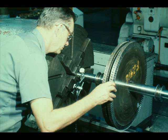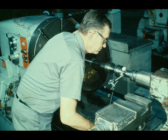The turbine shaft must also be checked for straightness, as the workman is now doing with his dial indicator. The next step will be to check all of the shaft fits for run-out with the indicator — that is, all of the shaft fits that you miked a few moments ago.